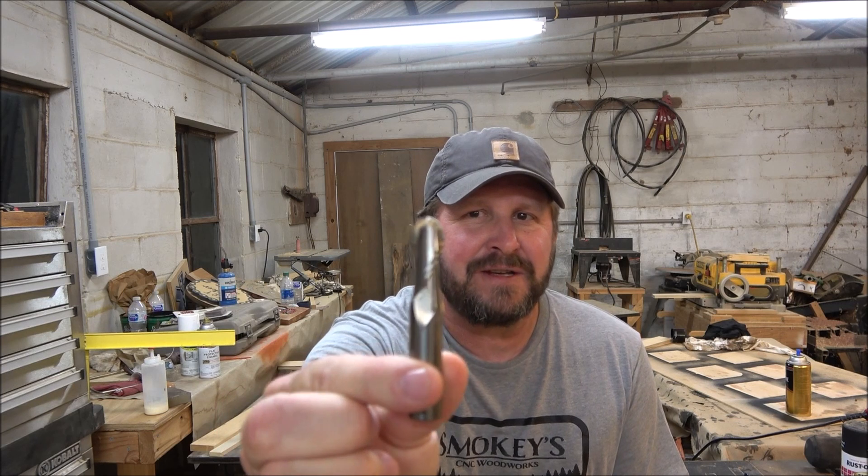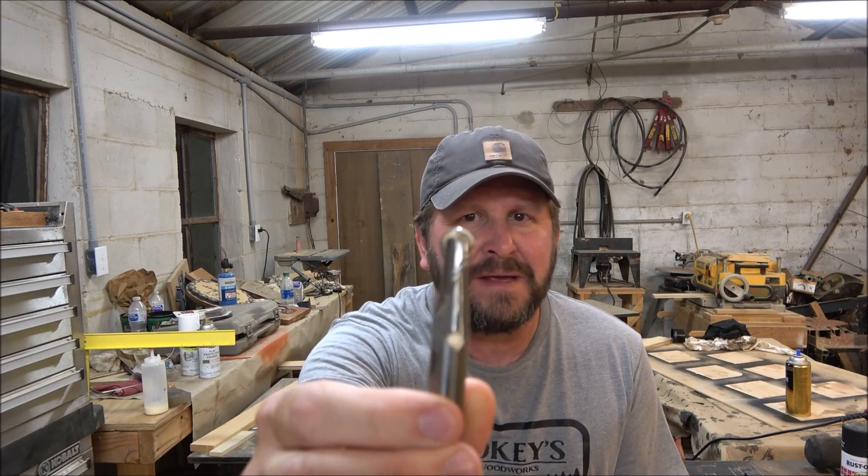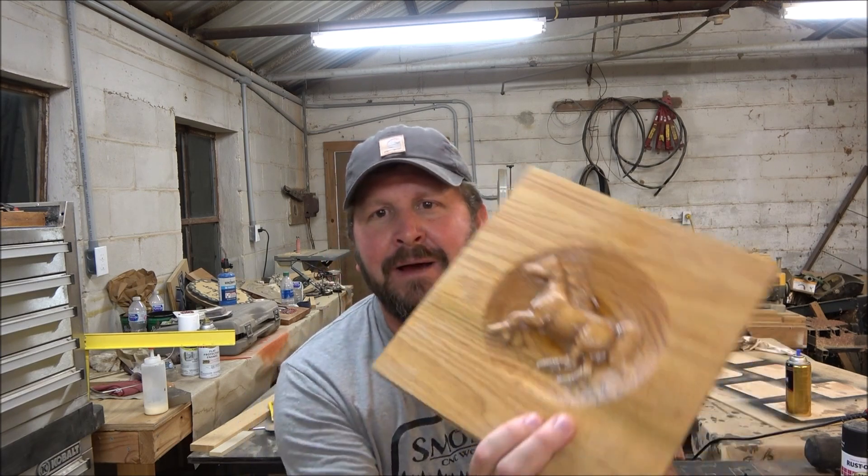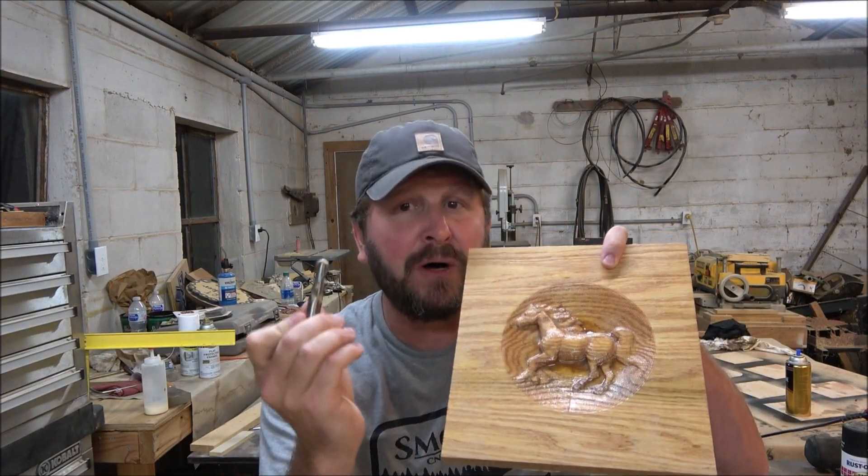So today we're going to talk about a few more CNC bits. When I do a wahoo board, you saw me doing that breast cancer awareness wahoo board and you saw the bit just going through and stabbing a hole — that's called a drill tool path. I do that with a half inch ball nose. You can see it's a rounded bit. Now the ball nose isn't necessarily meant for that. When I do stuff that's 3D, kind of like when I did this horse, this 3D horse, that's what I use as a ball nose.